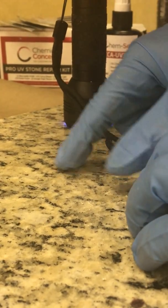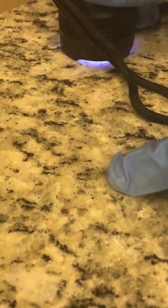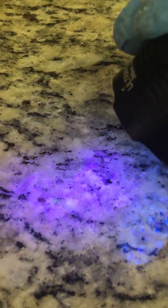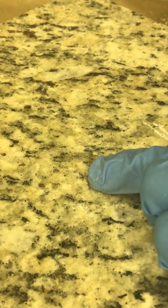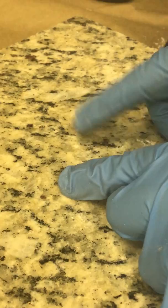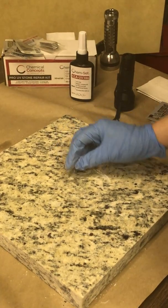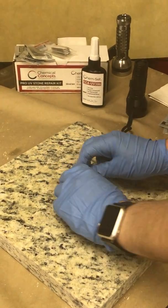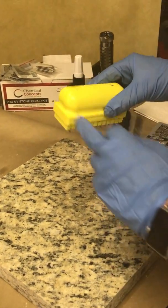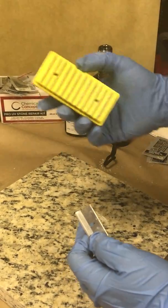It's been a minute and we're fully cured. Now an important point: this is a UV lamp and UV rays are harmful to your eyes, so try to wear protective glasses, or at least don't stare directly at the light while you're using it. Typically a straight razor is used at a perpendicular angle so as not to pull up the adhesive, in a back-and-forth motion. Some stone fabrication supply places sell a handy tool that holds a bunch of straight razors stiff — that's a great little tool, though we don't sell it ourselves.